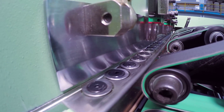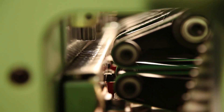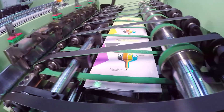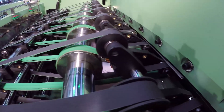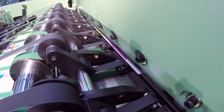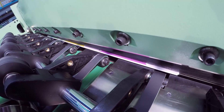A mechanical square back pressing system with cam follower bearing makes perfect edge squaring with uniform pressure. The folded book bunch then enters the precision, high quality top and bottom long knife front cutting unit for accurately cutting the front side of the book bunch.